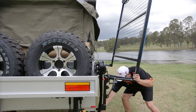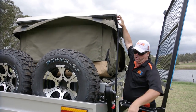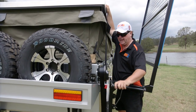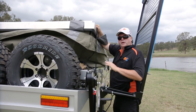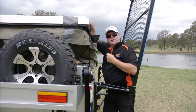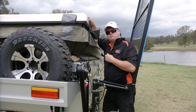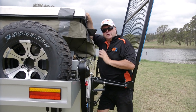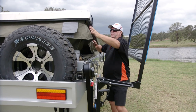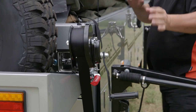Just a matter of undoing some of the line out, taking it around the bottom of the boat rack, and going up to the top where we've got our eye bolt. Click that in there. Now what's going to happen is I wind the winch over — it'll pull it down and hold it in position while I can walk around and check the canvas to make sure we're not pinching anywhere. It's essential that we get all the canvas in behind the seal. One little bit of canvas sticking out in the weather and the water will wick back into it — and you'll have a mildew problem. So I'm going around to check all the canvas is on the inside.